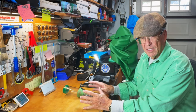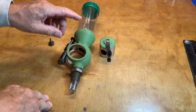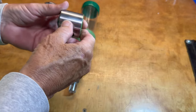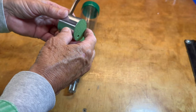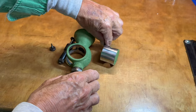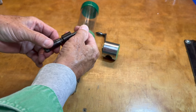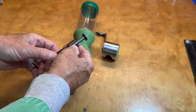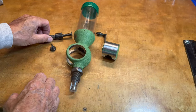Let's get down and take a closer look at the guts of this thing. When I got this it did not have a hopper — it was very very dirty. I got it cleaned up pretty well now. There was some very light surface rust on the rotor, but I went to the polishing wheel, just a couple of zaps, and got it shined up. It's in good condition now. It came with the large pistol chambering meter, and I tried that with five and ten grain charges and it's just very unreliable. So I was able to find over on Midway a replacement small metering chamber.